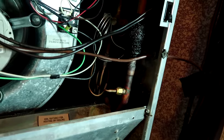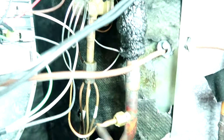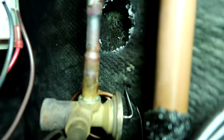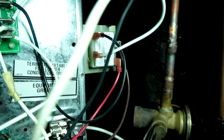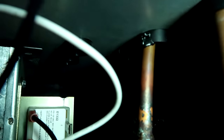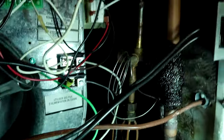I'm going to have to sweat this one off man, it is tight - look at how tight that is. What I do is I get a squirt bottle and wet the crap out of it. Look, somebody burned it - there must have been the installers. I've got to take that transformer off right there and move it over so I don't burn it. Somebody already melted the grommet - see how it's melted? Look how tight that is.